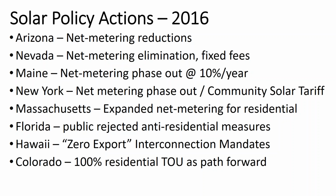Maybe if you're doing a solar design with new construction and you're using split HVAC units, maybe some of your HVAC units are going to be variable speed loads. Maybe you want to crank them in the middle of the day and have some thermal mass inside your building so that you can ride out the evening when you don't have that electricity on site.